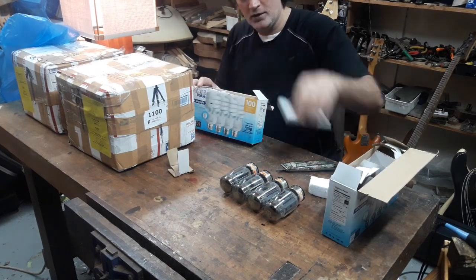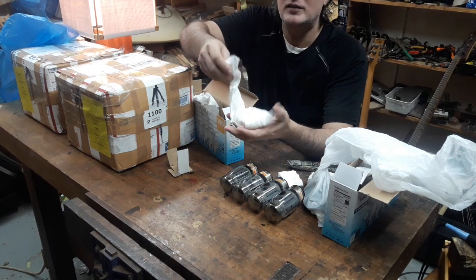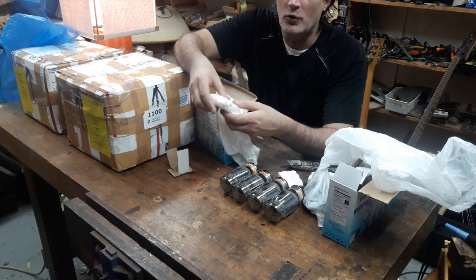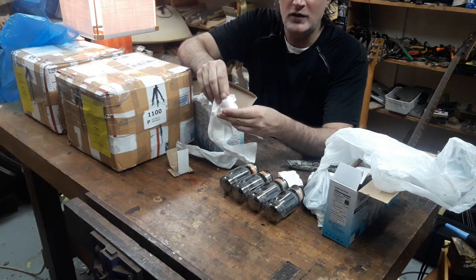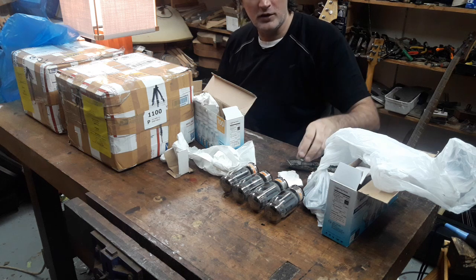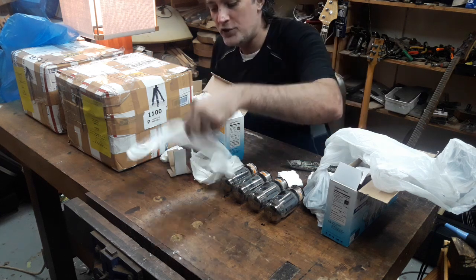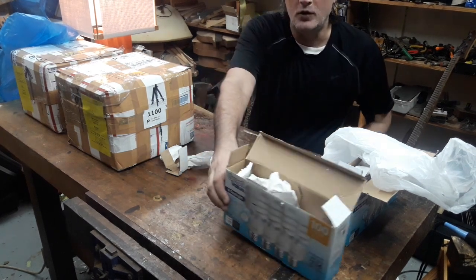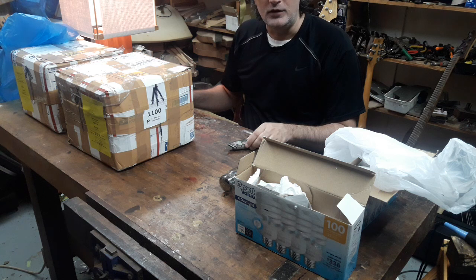And this other box here I guess is the driver tubes, right? So these are I think 6922s. I'm not familiar with them. Oh, these have Curcio upgrade driver boards. I'm not sure that I'm saying that name correctly. Curcio 6922. And the original driver tubes for Mark 3s were 6AN8A, which I've only heard being criticized as not being so great sounding. So most people opt to swap them out. But this has Bob Curcio's updated driver tubes, right?